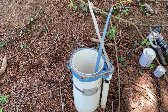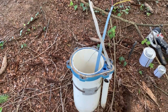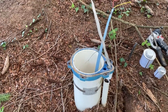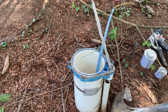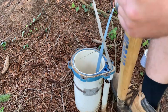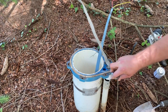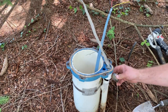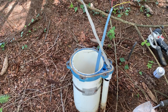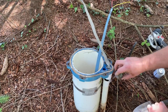Whenever you're working on these systems, it's a good idea to pay attention to what's around you — are there any Comcast cables, Verizon cables? You should be calling 811 and making sure you know where all the utilities are. In this particular area we already did that since we were working on the septic earlier. So we're going to go ahead and clean off the rest of this pipe and then get the glue set.